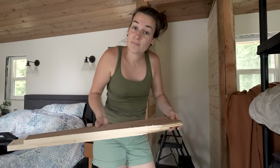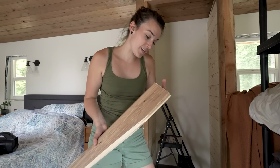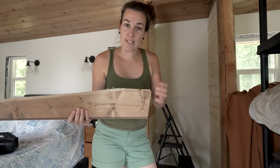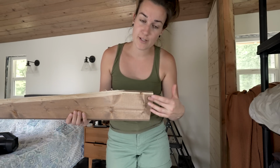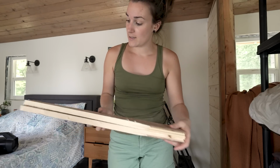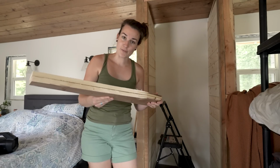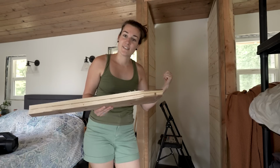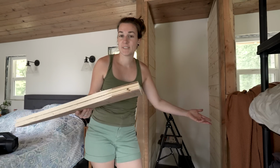And now I'm gonna try and put them in, see if they will work in the ceiling when we wanted to install the very last piece. The piece before that, we cut the back of the groove off so that the tongue didn't have to fight in. So I didn't do that this time. So we'll see how that goes. Hopefully that's not gonna be a problem, because that piece is in. I can't take it out to cut out the groove, so see how this goes.